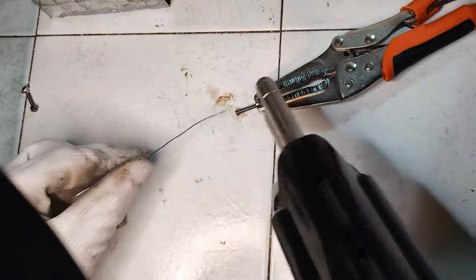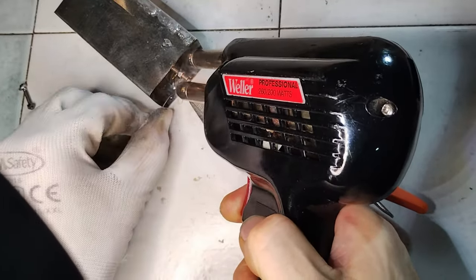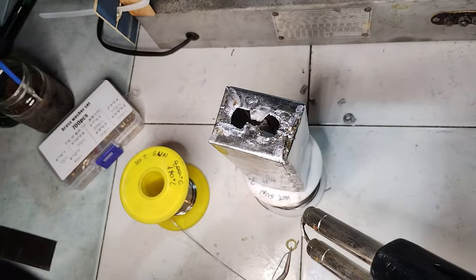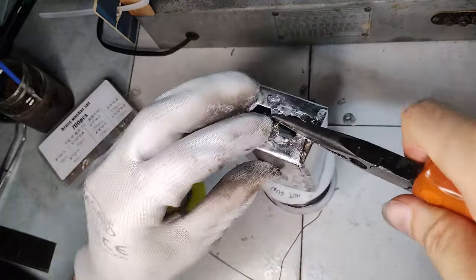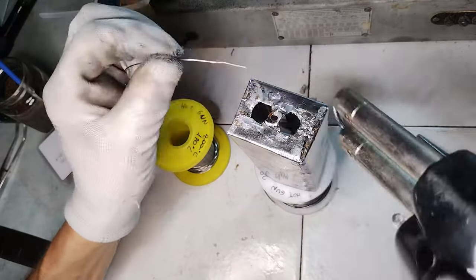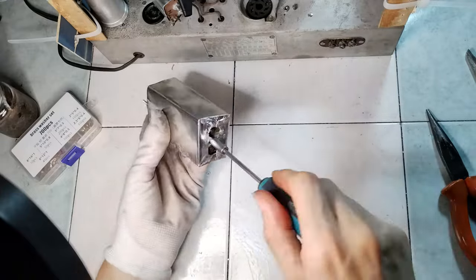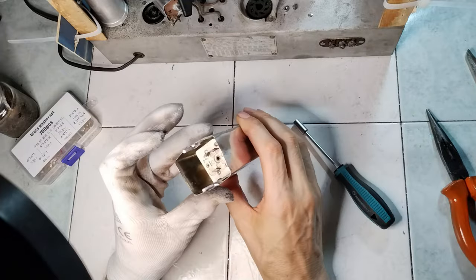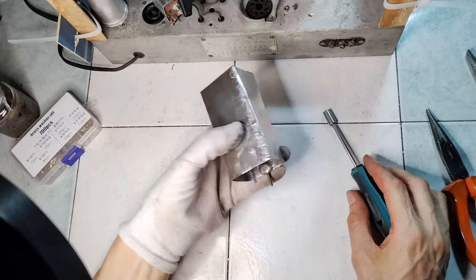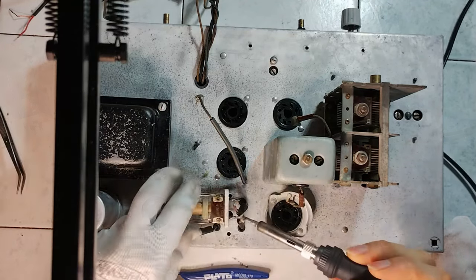Two screws without head must be soldered at the bottom of the can. One brass washer is soldered on top of the can for connecting and holding the body of the IF transformer inside the can. The chassis of this radio was not designed thinking of possible maintenance for the IF transformers, and installing the new can requires some ingenuity.